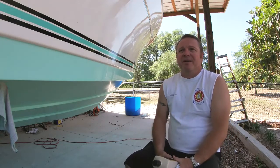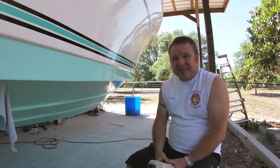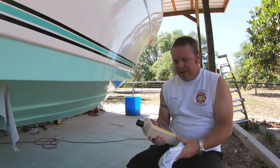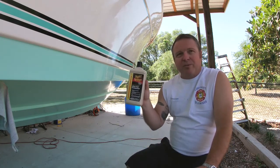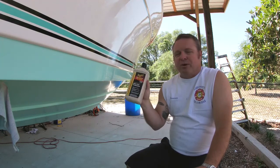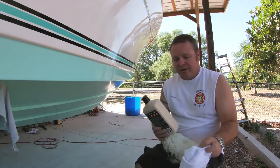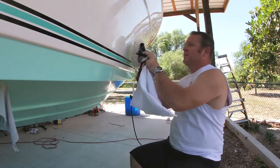On this boat we have the outside — everything you're going to see — polished to a mirror shine. Underneath the boat I'm kind of getting lazy; I don't need to go that far with it. How I got all this shiny — you can pretty much see your reflection on the boat — this is just Meguiar's that I use. I started out with an UltraCut 105. You can get this at Harbor Freight or any auto parts store. Use the UltraCut compound. I put it on with a buffer. Get a clean buffing pad, make sure there's no dirt, lay this on top of it, squirt enough out, smooth it into your surface, and then you can start buffing it out.